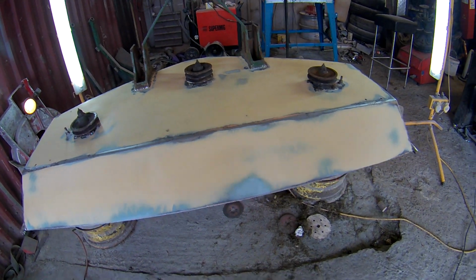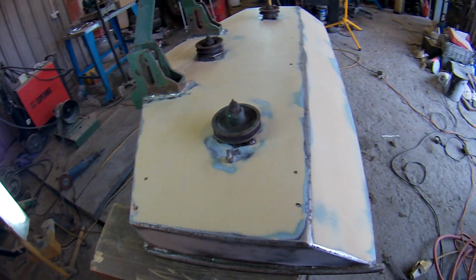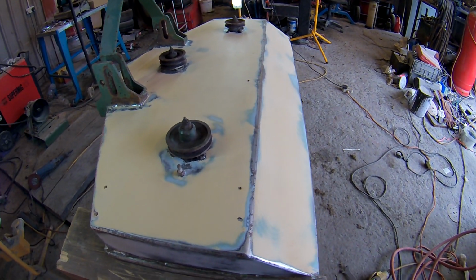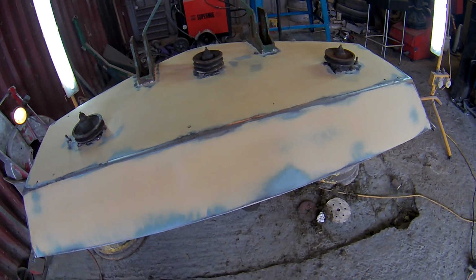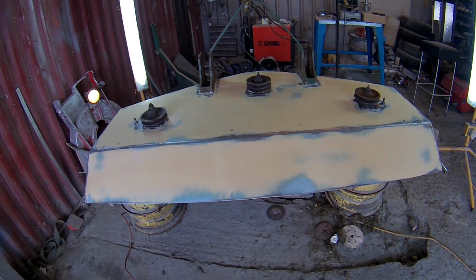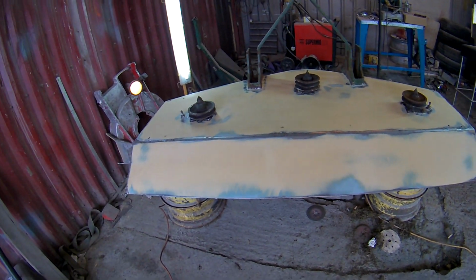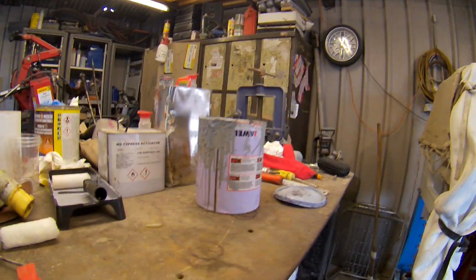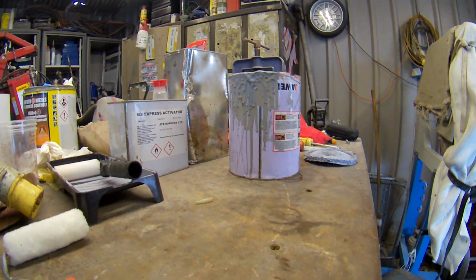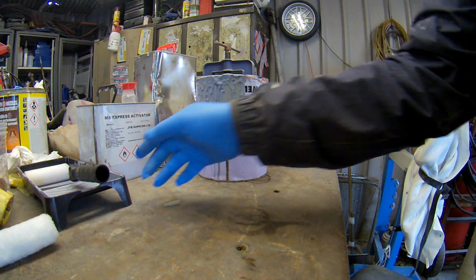So we're going to two-pack prime it in a minute. I like two-pack primer, it's the 2K primer. It's the proper job. Seal it all up, because it was getting damp all the time. After we prime this, I'll turn it over next week and we'll have another video, where we start underneath. I'll mix up the primer now. I do a 4-to-1 and I roll it on.